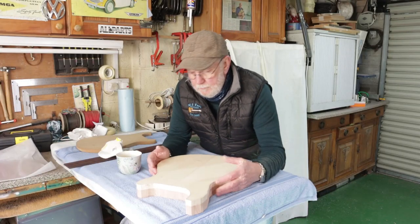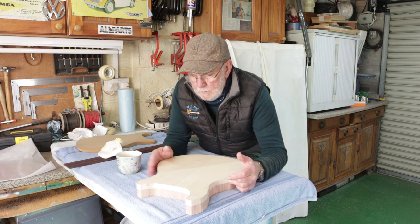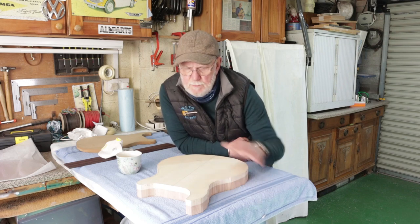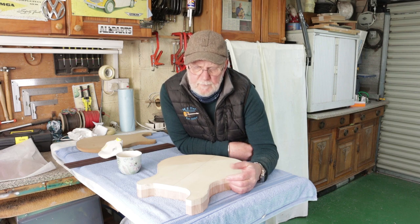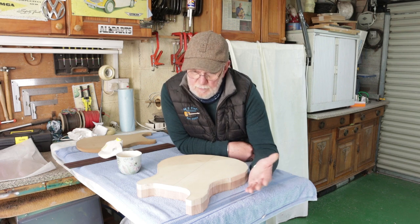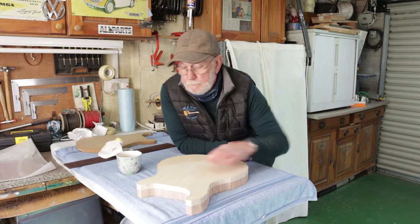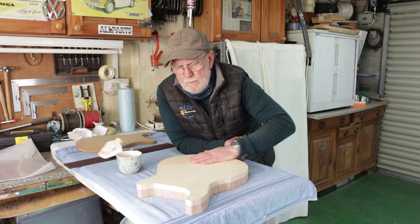There's a body roughly cut out. I was struggling a little bit then with that bandsaw. It's a little bit wide, that one was, for the curves. I put it in a while back to cut some necks, to cut the angle on the top of the headstock. Normally you tend to use a blade that's a little bit narrower, but as most people know, once you've cut curves, that blade is no good for straight cuts. Bandsaw's not the best for straight cuts anyway, but for a headstock and things like that, of course, they're perfect.